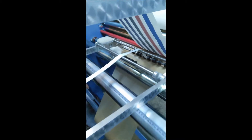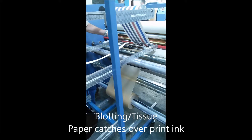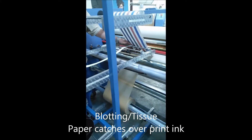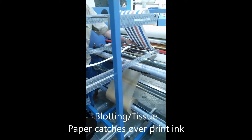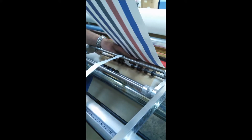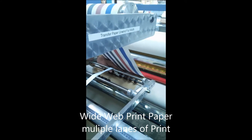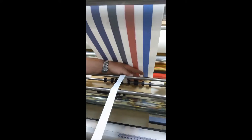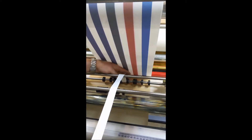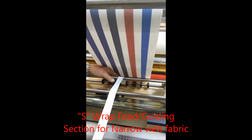To thread the machine up, you will first need tissue paper, and the tissue paper is always started first. Then the print paper, which can be taped to the tissue paper with heat tape, and then your products taped to the tissue paper to line up via these small collars adjusted with an allen wrench to make the alignment of the printed product with the print paper.